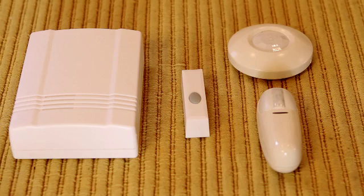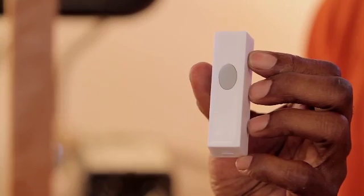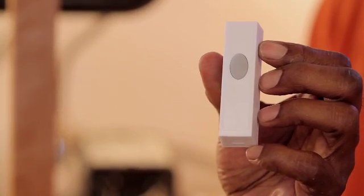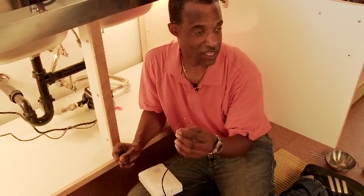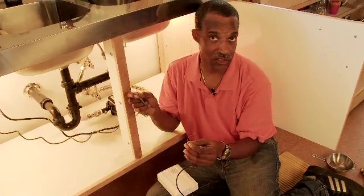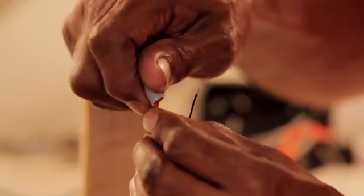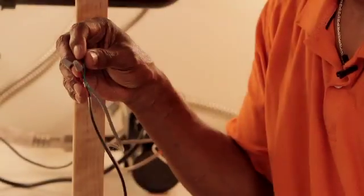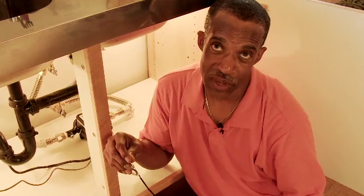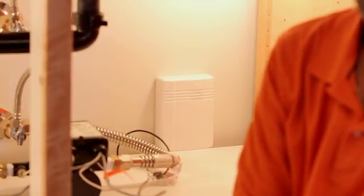The ACT demand system also comes with a receiver, as well as a wireless remote which works up to 80 feet from the receiver. On the actual receiver itself, we have three wires: green, black, and red. We're going to attach the same corresponding colors to the actual pump itself using the supplied wire nuts. Now with the necessary connections all made, we can place the receiver on the back of the cabinet and secure it with a small screw and/or Velcro.